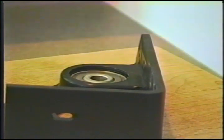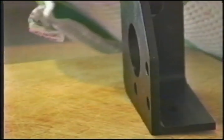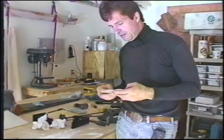Now, I'm going to do one at a time. I'm only going to embarrass you with one. And there we are. You notice how this bearing is well below the surface? It's because of the wall thickness of the aluminum here to handle the thrust load. Put our step bushing, the shouldered bushing, in there. We'll take care of that handily, and we'll be back with you downstairs to show you the final installation of the MG30 bracketry, back drilling, and such.